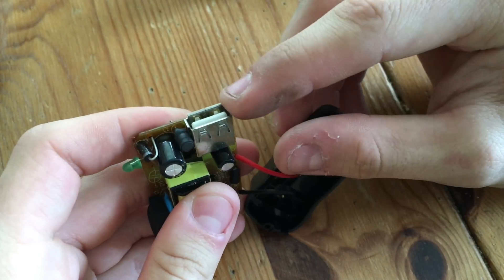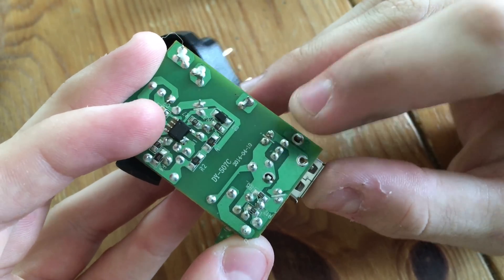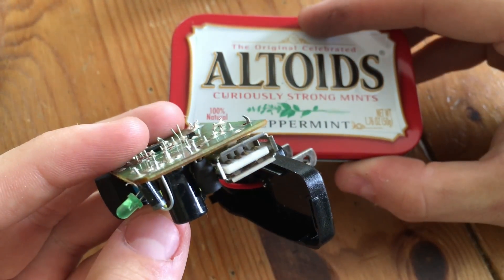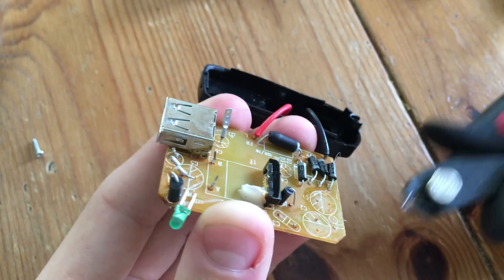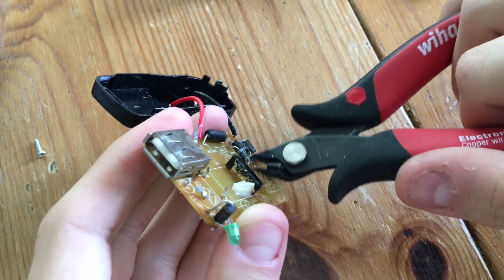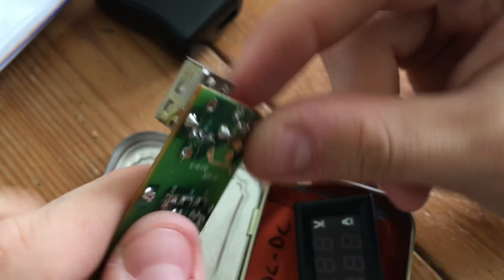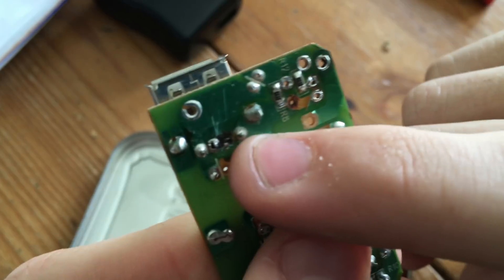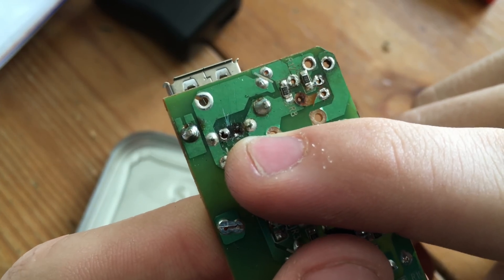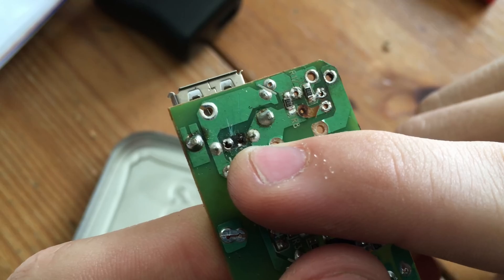You can see right here is the USB port that we want to salvage. I'm going to desolder all of the connections to the board. I took a pair of pliers and ripped off all of the electrolytic capacitors, and now I'm cutting off all of the remaining components. We're going to put our resistor network on top of the circuit board, pass the wires underneath, and solder to the four pins of the USB port on the bottom. The two data pins were originally tied together by the circuit board, but I scraped away the trace so we can drive them independently with a separate voltage.